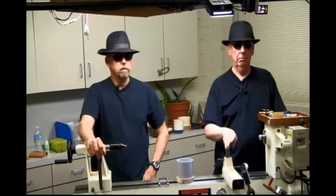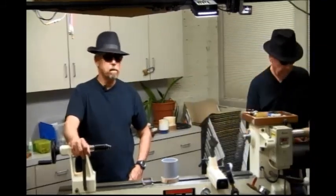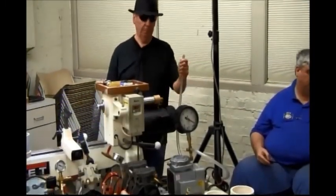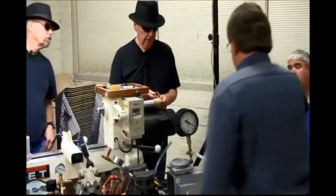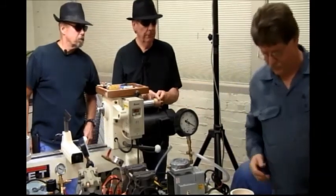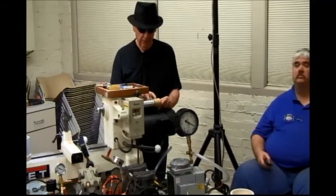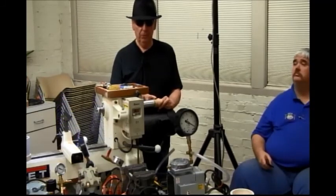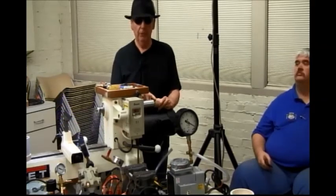Any other questions? Where the hose and the valve goes into the back. Okay. How does that go in? It's just a friction fit. My question is, how does this elbow spin? Is there a bearing here and there's space between them? Yeah, you cement the bearing in. You cement the outside of the bearing in. Yeah, keep the epoxy off the inside of the bearing. And there is space in there, so you've got to seal this adapter so that it doesn't leak as well. So CA glue or a good wood sealer on it. There is some space inside.